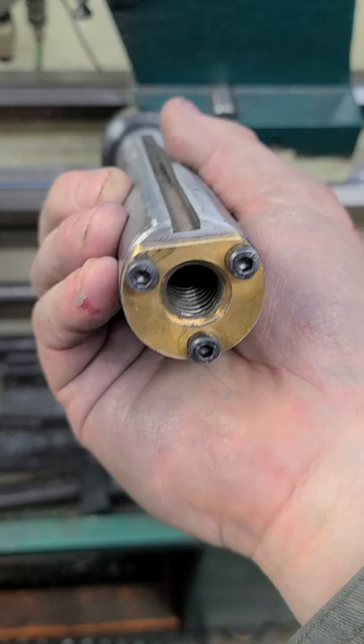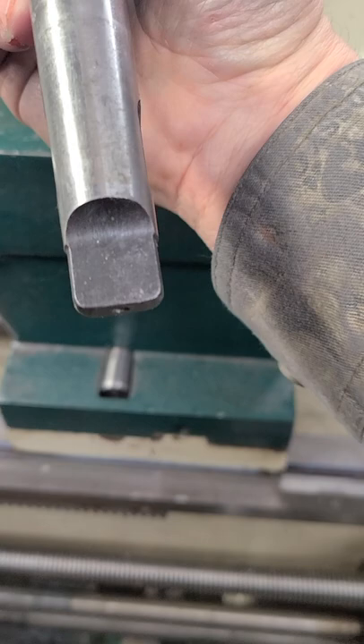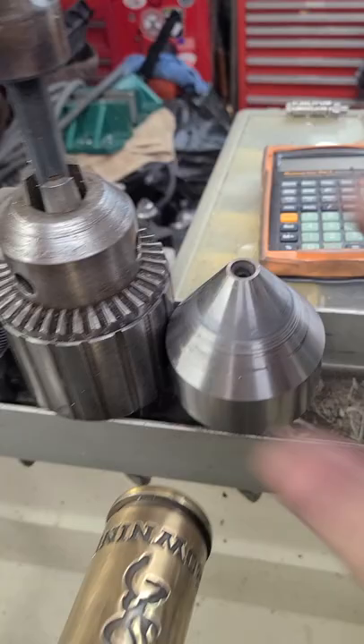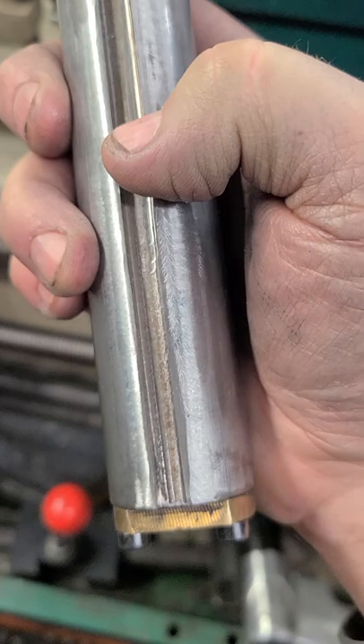That's kind of like trying to move sand with a pitchfork. Anyway, so you've got that little piece on the back, and inside here, where it locks in, where the tapers lock in — it tore up. Not a real big deal. It's soft material. My main thing is repeated use and how that locks. You can see over time how it would just swage and raise. I'd have to pull it apart because it would make the tail stock very, very difficult, if not almost impossible to turn.